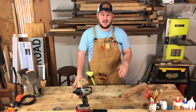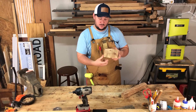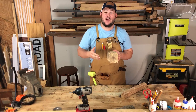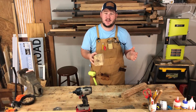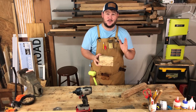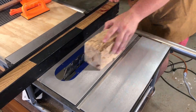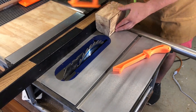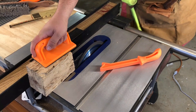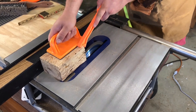There are two major elements to a joiner's mallet: the head and the handle, which join together. Now to start, I'm beginning with the mallet head. My sizing is a length of 4 inches, a width of 3 inches, and a height of 3 inches. We'll cut this on the table saw for a perfect, square pass. I set the fence at about three and a quarter inches to give a bit of excess. My blade height is set to about half the width of the lumber — I cut, then flip to rip the full piece for a safer cut. Once two sides are square, I set my fence to three inches and rip the remaining two sides.